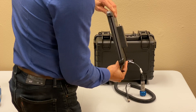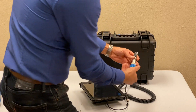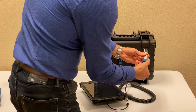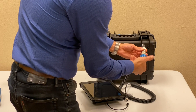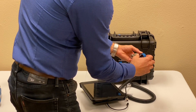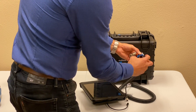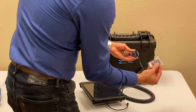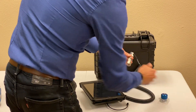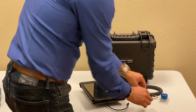These are the core parts of your vibration analyzer. Of course you need an accelerometer, and it comes with one. The accelerometer itself is a standard industrial accelerometer. It comes with an extra magnetic base — a very solid, high-force magnetic base, around 80 to 85 pound-force. The bottom is designed so you can use it on round-shaped rotors, and it also comes with an extra flat washer so you can attach it to any flat surface. The accelerometer is connected to a cable with a connector that goes to your two-channel data acquisition.